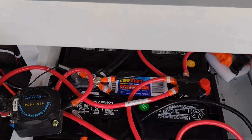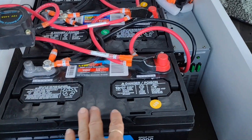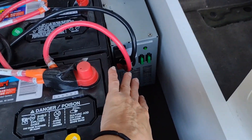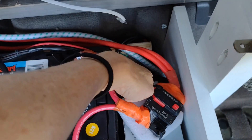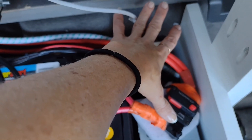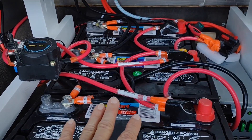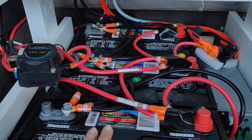The batteries themselves are protected by a piece of flooring that I put over here. There's still some natural venting because I don't close it in at the front and the sides are open as well. I need some airflow for the battery charger so that it gets airflow behind and in front of it. I do have a 200 amp circuit breaker so that I don't run the risk of causing any fires if there's a major influx of power. The flooring that covers the terminals also stops the risk of sparks from any contacts above.